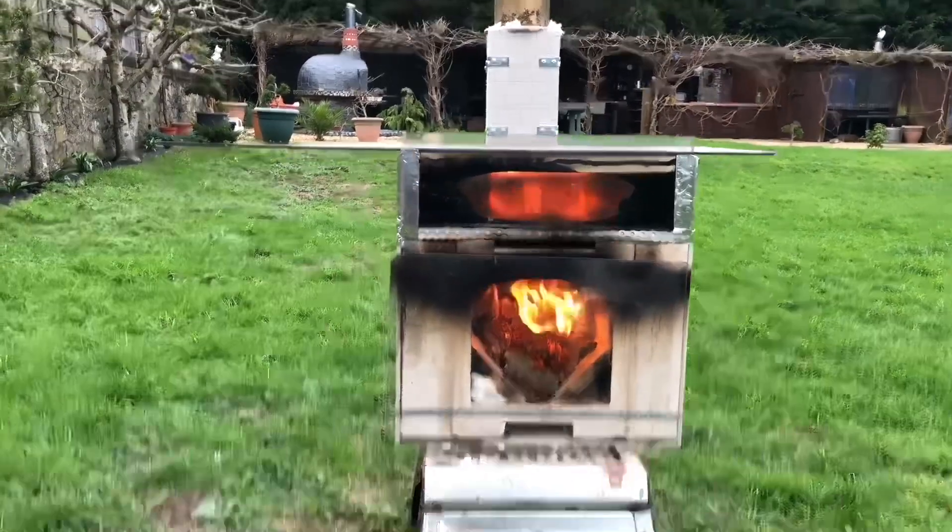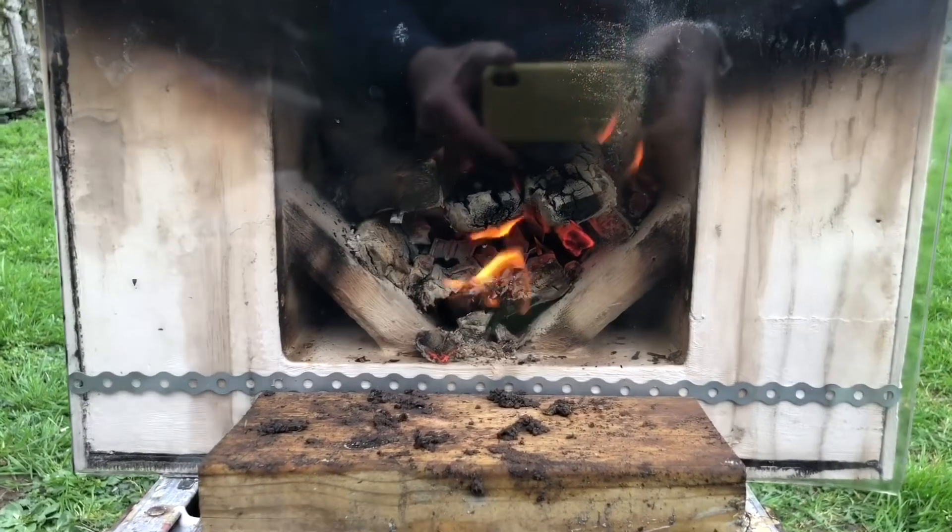Now with the main air completely cut off, you can see how the secondary air is definitely working. You can see the air is igniting the hot gases that are coming up through the vortex slot underneath here. There might be a little bit of air getting in but virtually none. It's working really well - first time I've really seen the secondary air working properly.